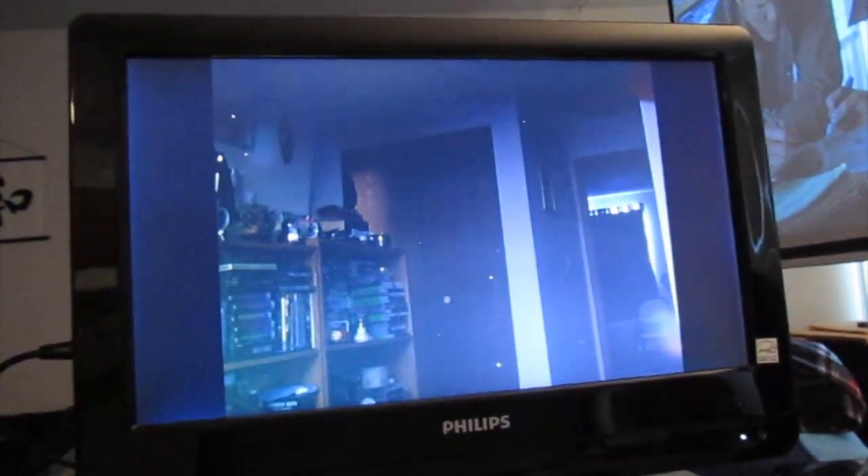I've got to reconnect here. I'm going to zoom just one, and it jumped a massive amount — it should have made this little baby step forward, but it jumped significantly. I'll just do another couple of little baby steps here, and it's jumping these massive amounts until it hits where it changes over. You can see the count here of the internal command — it's 8, 9, 10 — going up by just these tiny tiny bits. And now it hits 17, and it zooms back out.